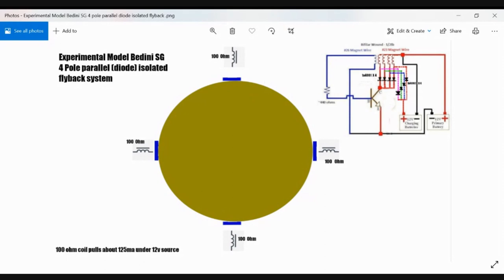If they're all being triggered at the same time, there should be no problem there. I say that because I did one experiment once when I was trying to trigger two coils around a rotor that were 45 degrees apart, and they were also being triggered 45 degrees apart. These coils are not being triggered apart. They're being triggered together. So you won't have any issue with feedback. If you trigger them in a staggered fashion, and you trigger this one before this one, and they're too close together, then the EMF field might trigger the one close by. I've had that experience before.